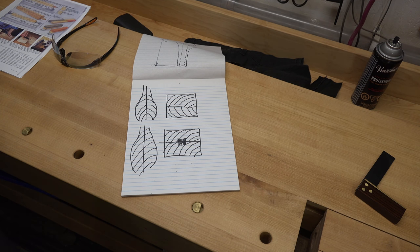The three-quarter-inch dado blade is set up to a height of three-eighths of an inch. I've set the fence so that our dado will be roughly in the center of our block on our flattened side of the lamination. Pay attention here — you've already laid it out to get your grain and growth rings going the right way, so now make sure everything is set up correctly so that when you run these dados through and sandwich the two pieces together your dados are going to line up.